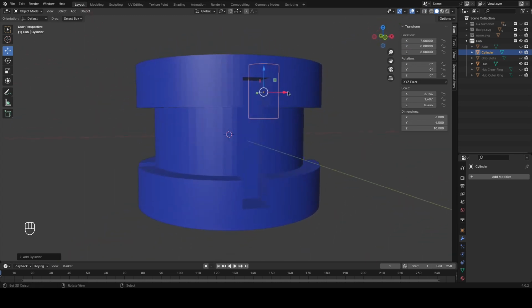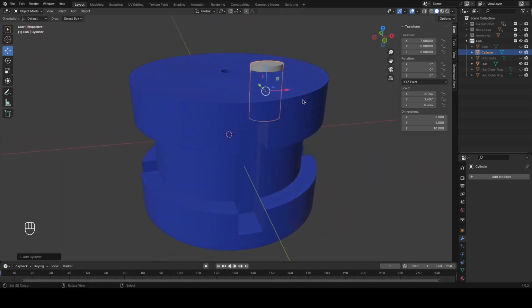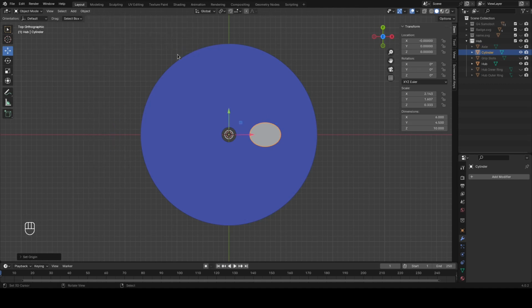And so this pops the decorative pocket that I'm going to create in the top of this hub out the top. And similar to what we did with the grip slots, I'm going to create a number of these. I'm going to start by moving the origin of this geometry to the 3D cursor. Remember, you have to have your 3D cursor at the center of the geometry. Shift C will put it there. I'm now going to duplicate this object that I've created, escape to hold it in place, and this time I'm going to rotate it around the origin in 60-degree increments. So here on the Z axis, I'm going to rotate it 60 degrees.